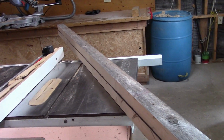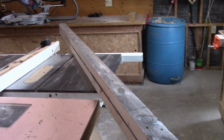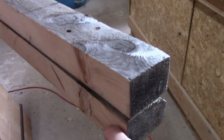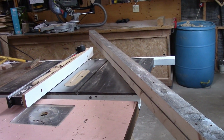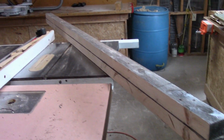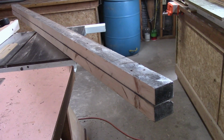And what I'm going to do is go out there now where I want to locate it, dig a little trench, and set that in the grade, no more than the depth of the first piece of 2x there. And we'll set that in place. Shouldn't need any spikes because it's going to be set right in the grade, and then I'll be able to backfill my gravel against it.